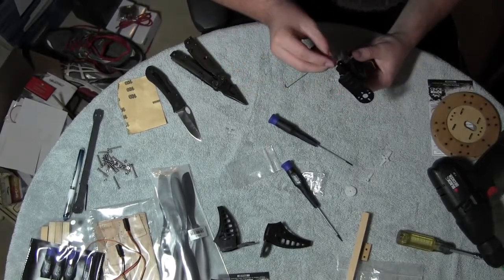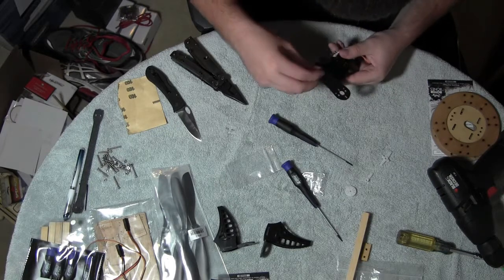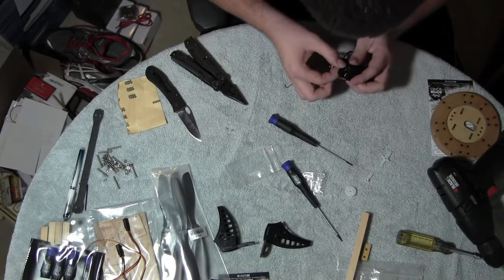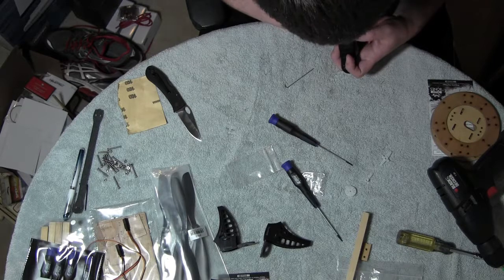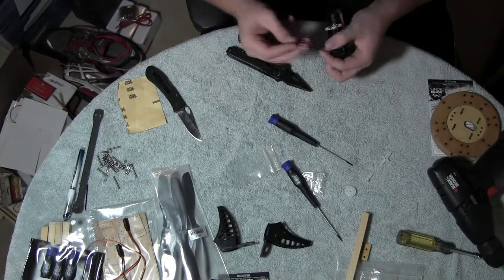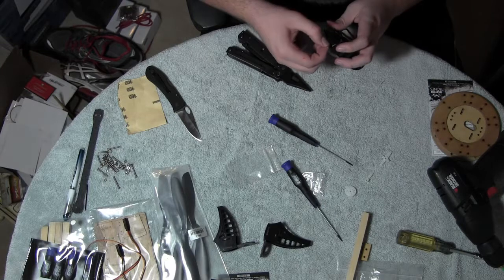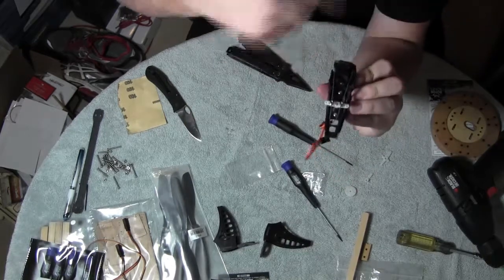And so now I'm just going to go and mount these up, put the push-pull rods in, and then from there, my fingers are too big, so I'm just going to use my pliers. Alright, there's one. And I'm going to mount the other one. One thing you do want to make sure of when you are mounting the push-pull mounts on the servo is that they're facing almost vertically, so that way you can mount up the push-pull rods.